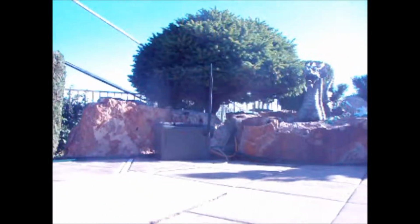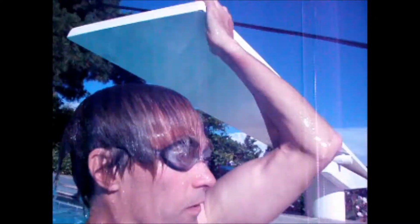Both those wires go over here into this box, which I'll open up in a minute too. That has an Arduino Yún chip in it, which has Wi-Fi access, but unfortunately they didn't supply an antenna connection, so I had to hardwire the Ethernet over to the ammo box, which has a wireless access point in it, which doubles as an access point to the backside. So let's open up that box and I'll show you what else it does.